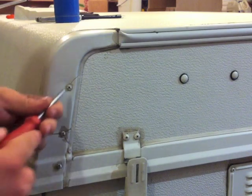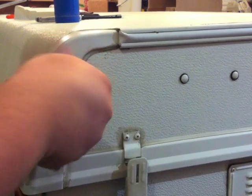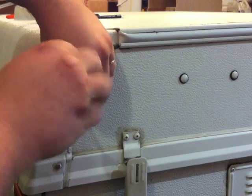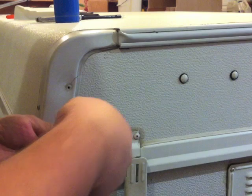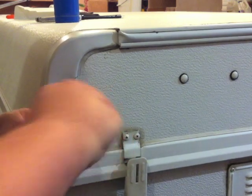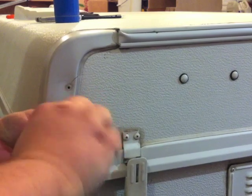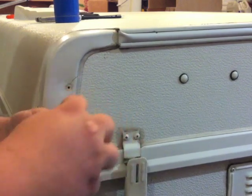The first thing is take the screws out. Now a lot of times I think what happens is people screw these screws in too tight, and that's where you go down the road and the trailer flexes at all, it's going to crack these corners. So when putting them back in, you don't want to over-tighten them — just snug.